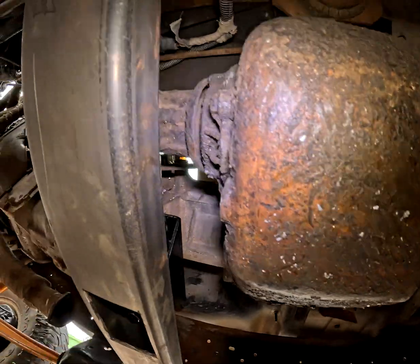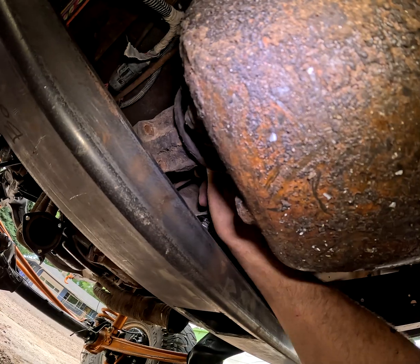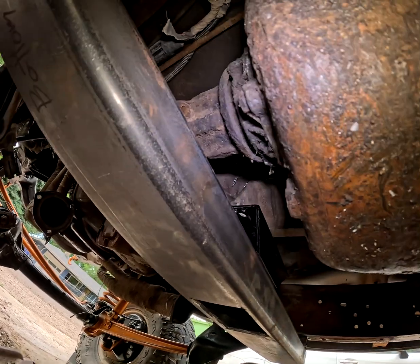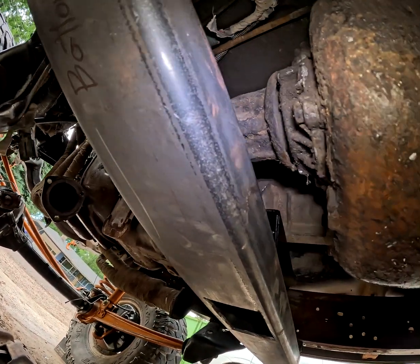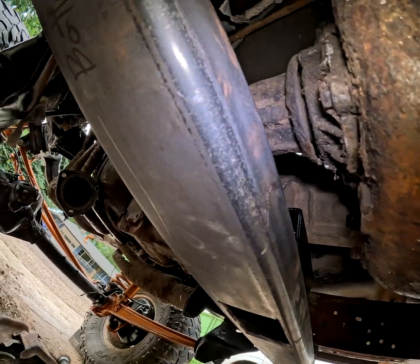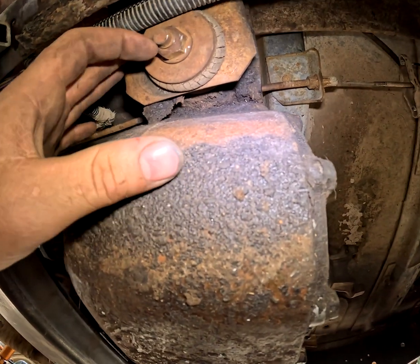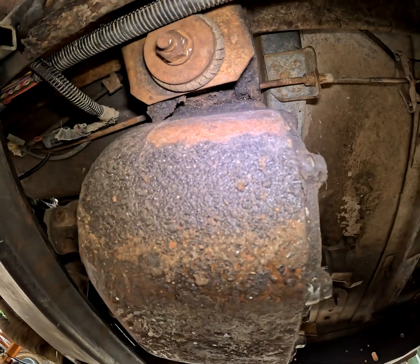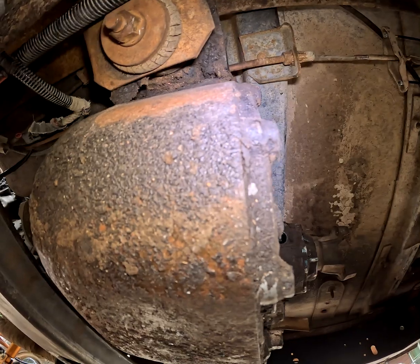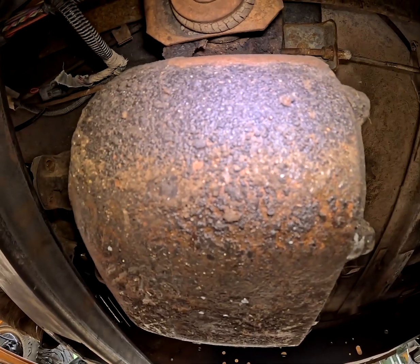And then when I go to put the drive shaft in, it feels like I've got enough actual room to get my hand in here as well with a tool. I mean, we can even sneak an extension in there, so we're not relying on, again, having to pull the cross member for something silly. And then as you can see, the transfer case is supported right here in the factory location. I do have to oblong the hole ever so slightly because the transmission length did change maybe 1/4 of an inch, not very much.